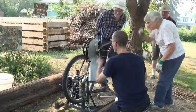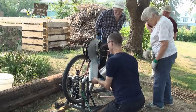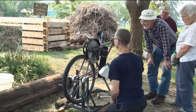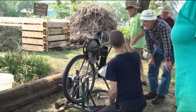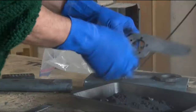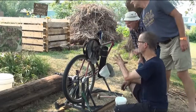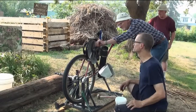This is the blade hole. Removing the clips, we get the front of the housing off. This is the blade that I fashioned at home with some machining tools — the one I forged at David's place. Treated it with charcoal to put carbon in it, then hardened it and tempered it. When I first set it up and was testing various things, over time it developed a few small chinks. So I sharpened it again and now it seems to be holding a little better.